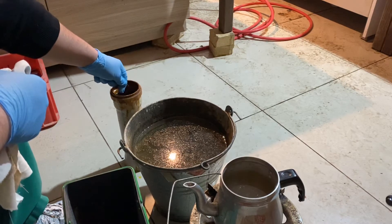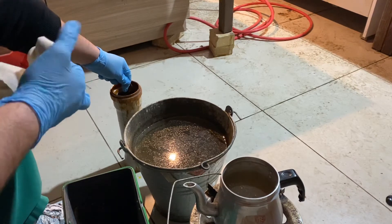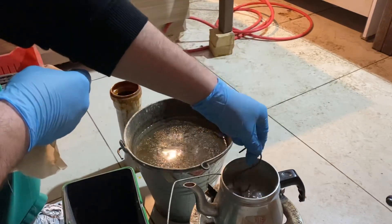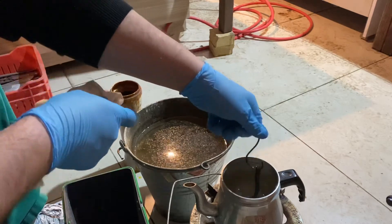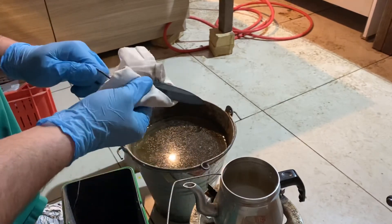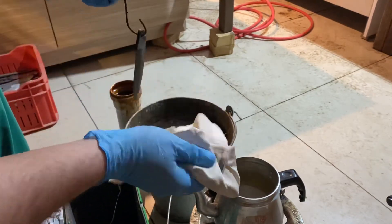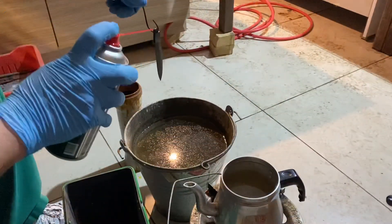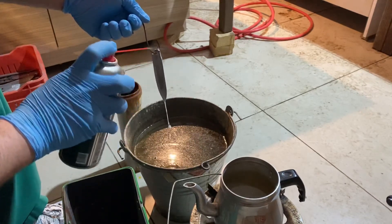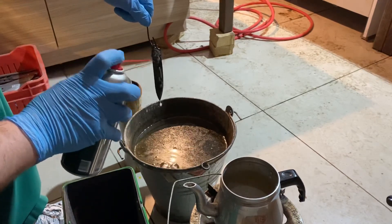In this case I'm going to leave it a little bit more because I want a darker etch. Make sure the knife is clean, then rub it down. Apply WD-40 or any oil to prevent contact with air. Leave it for at least about 12 hours — I leave it overnight — and that should be enough.